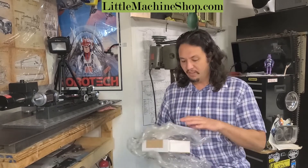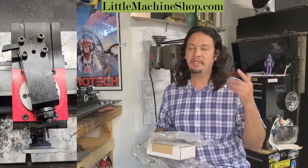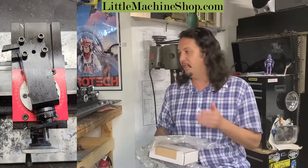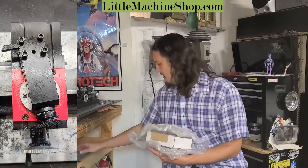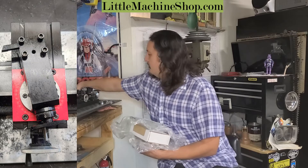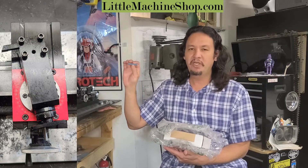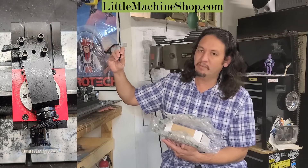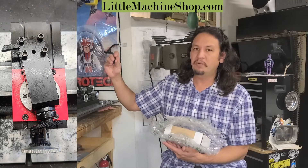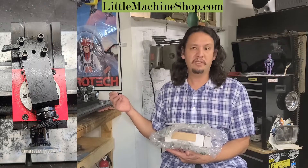Well packaged, as the previous one was. Now to be clear, one of the reasons why I needed a replacement is that I was rushing to finish on my tender wheels and I was having trouble with my compound slide attachment for my Sherline and sticking my tool holder out really far. These little quarter inch cutters were just not cutting it. The rear hold-down screw was not even hitting the back part with the way I was working with it, trying to cut the compound sides of my tender wheels — both the three degree on the tread and the ten degree on the flange.